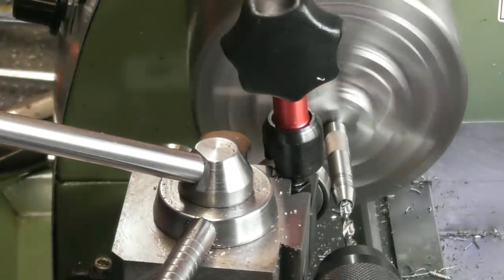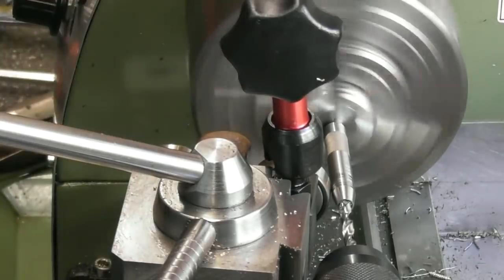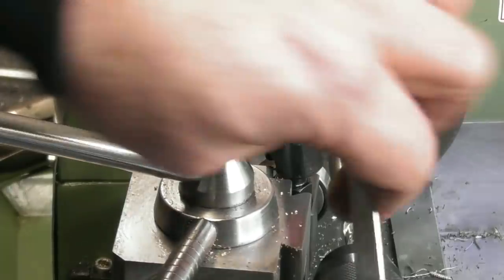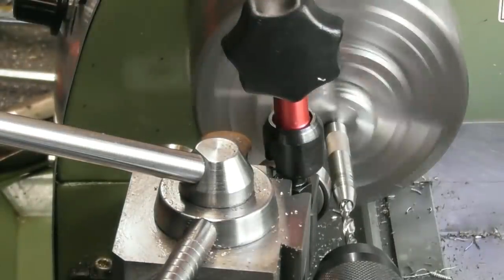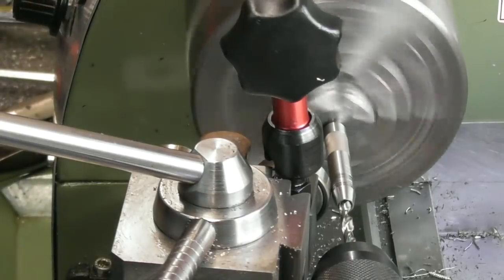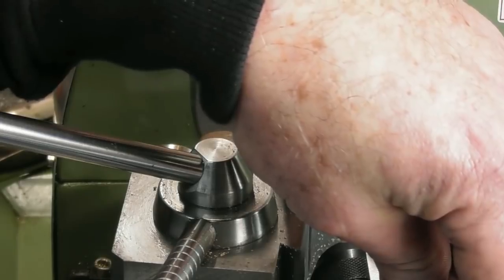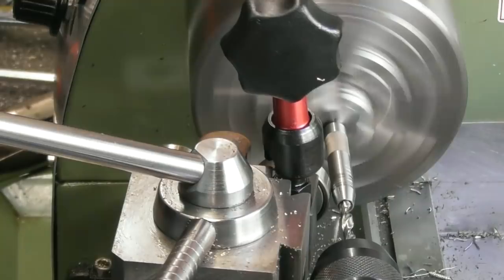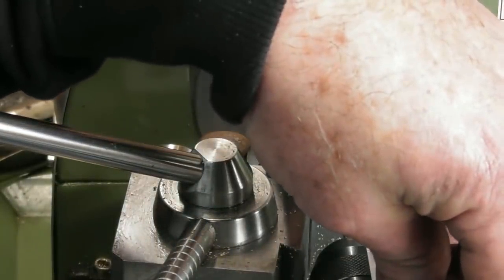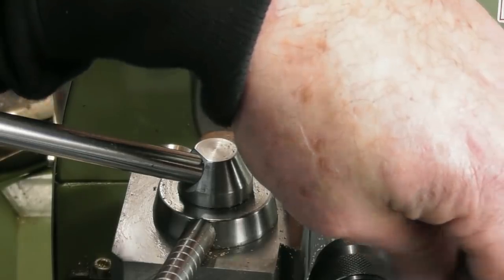What I found was when I put the new darts up, there's a slight discrepancy between the point and the barrel, so I've just put my little pusher bearing tool just touching against it so it's running true on the end. I'm taking it very easy — about five mil to go. Drilling out with the tapping drill. Could run a little faster I suppose. Another couple of mil to go — it's at 58mm. Another half turn of the handle. There's my 60mm.